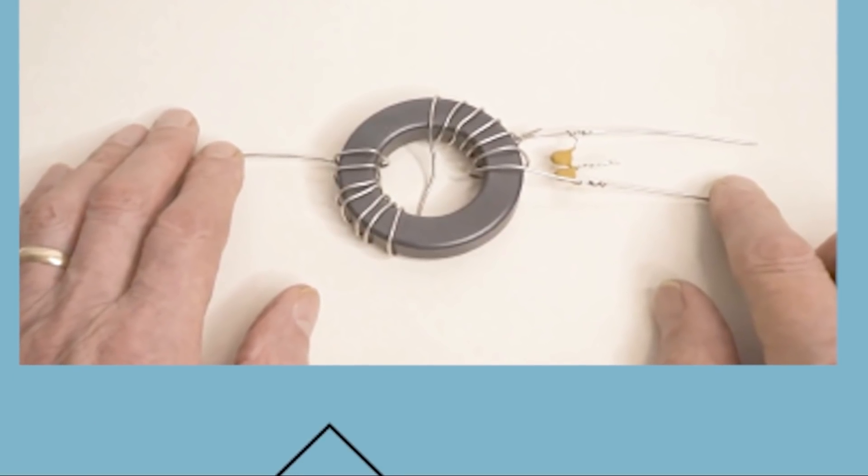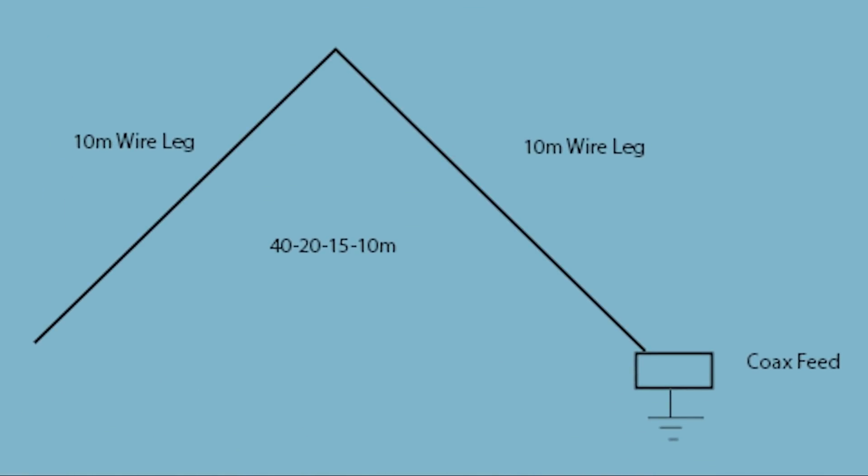Let's now look at a popular configuration people ask about: the inverted V. Here we've got an antenna which will cover 40 through to 10 meters. What length should this antenna be? It needs to be resonant on 40 meters. If you have an inverted V, because the ends are quite close to the ground, you will find that the frequency is lowered, so you need something slightly shorter than a normal dipole. The transformer also provides a bit of end loading because it's hung on the end of a very high impedance, which will also tend to lower the frequency. Start with the standard dipole dimensions and then trim it to resonance on the 40 meter band — I've provided a link below for a quick calculator for antenna resonant lengths.